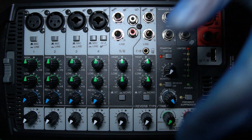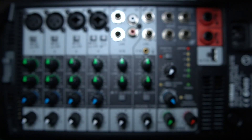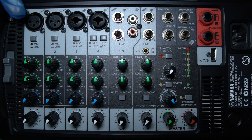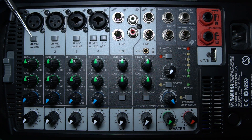The first thing you're going to do is take that XLR cable — the end that comes out of the wireless receiver — and plug that into this socket here. One end of the XLR cable plugs in here, and the other end plugs into the back of the wireless receiver. Once you've plugged that in, this button here: if it's pressed in it's on line, and if it's pressed out it's on mic. You want to have this pressed out so it's on mic. The next thing to check is all the green knobs — they should be exactly in the center where that triangle is.